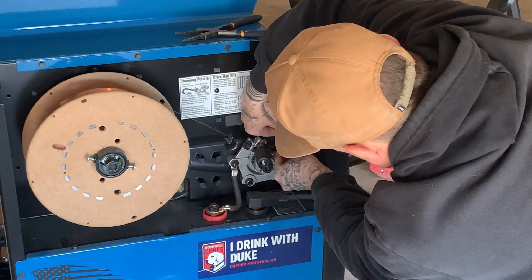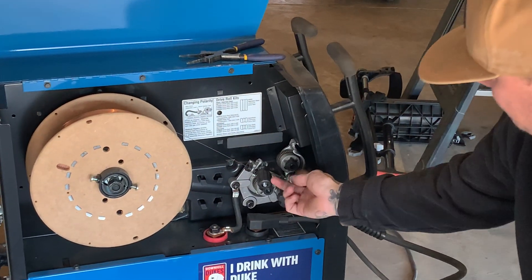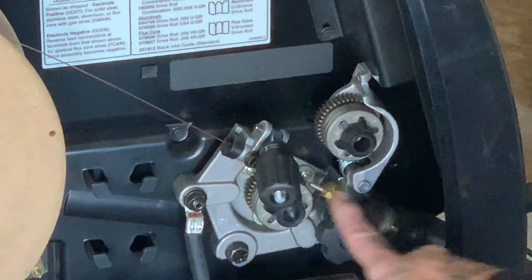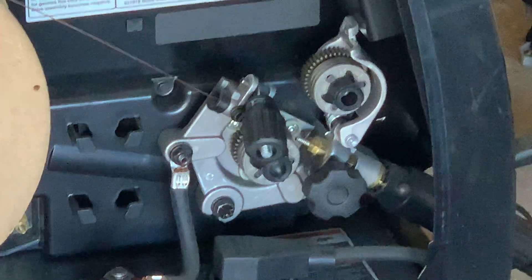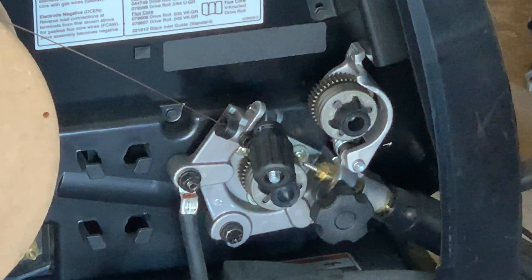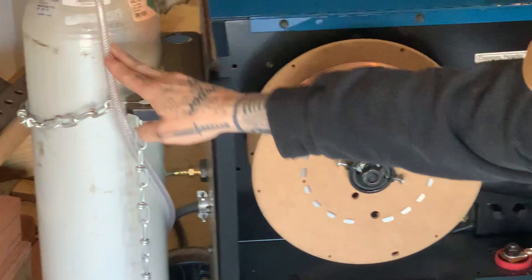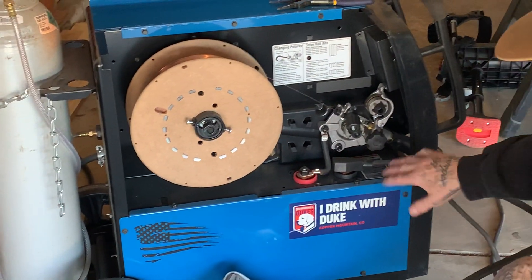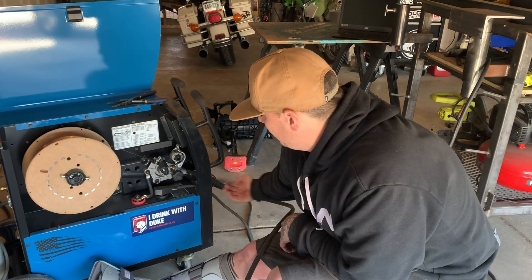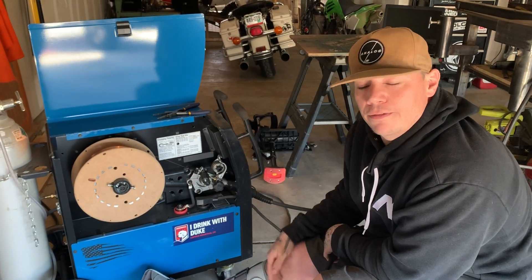These pop on here and lock into place by turning this — it's on both sides. You can also see here that's part of my liner coming out of my whip. If I unscrew this, I could pull my entire whip out to replace the liner or for transport. This is also where our shielding gas is fed into the machine through this hose — it comes into the back, goes through the machine, into the cable, and is routed to our gun coming out of the nozzle. You need to make sure the whip gets in there seated perfectly so we don't lose any gas — if we lose gas, we're going to have issues with our weld.